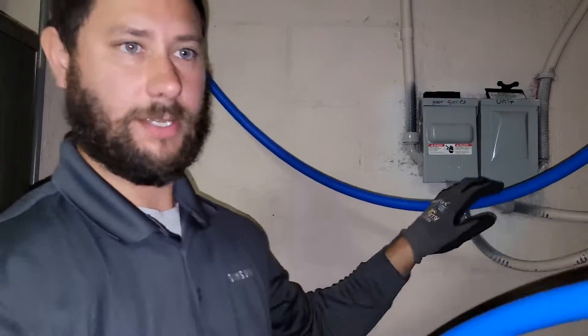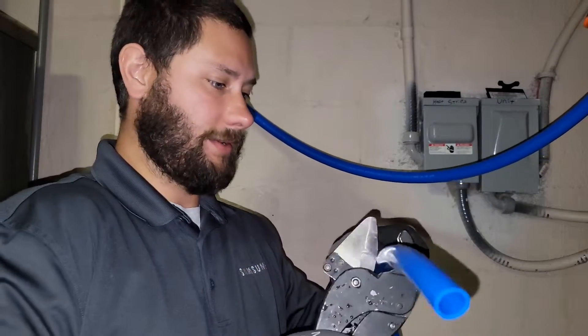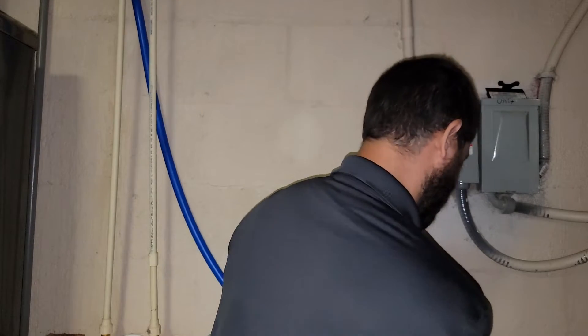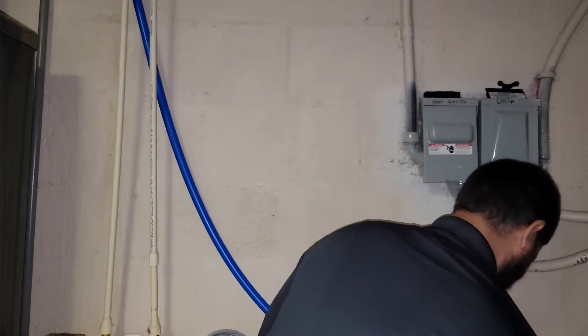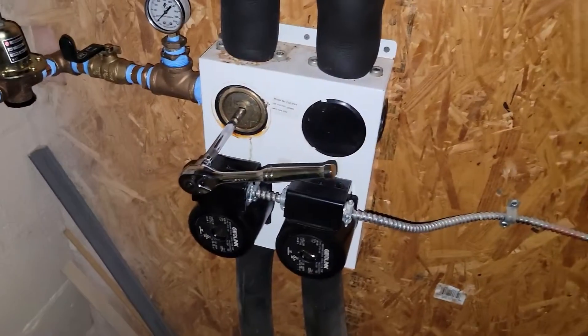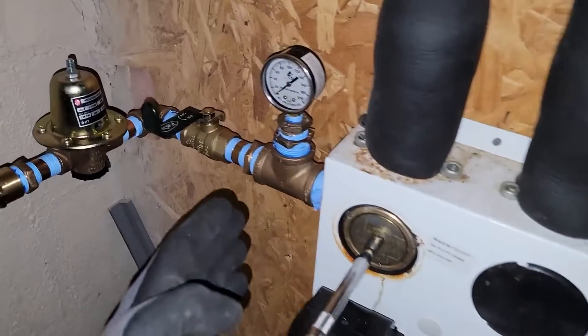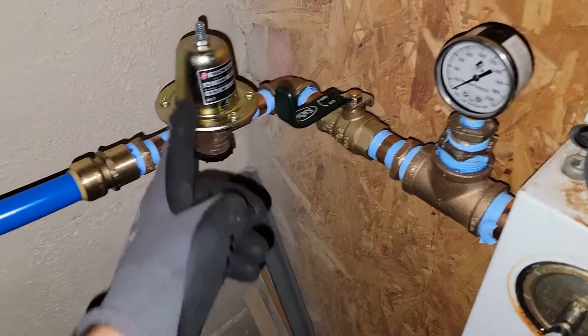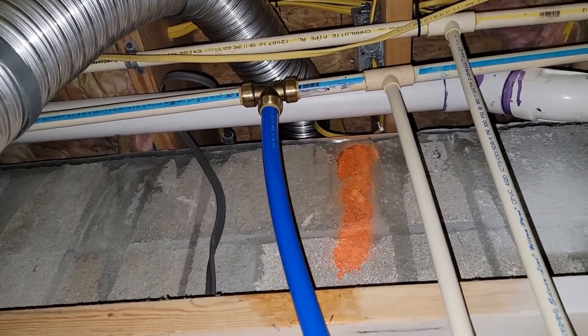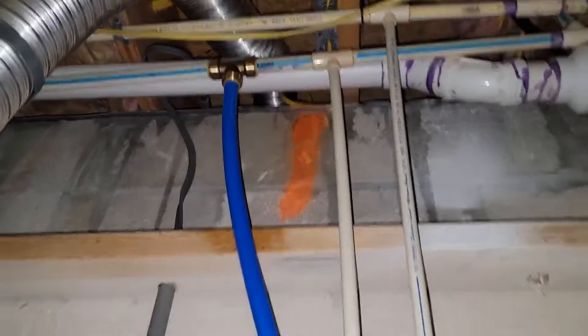Cut a little short piece here and it's connected and installed. So we've got our pressure gauge, shutoff valve, reducing valve, SharkBite fitting, SharkBite shutoff, and then a SharkBite T up there connecting to the water supply.